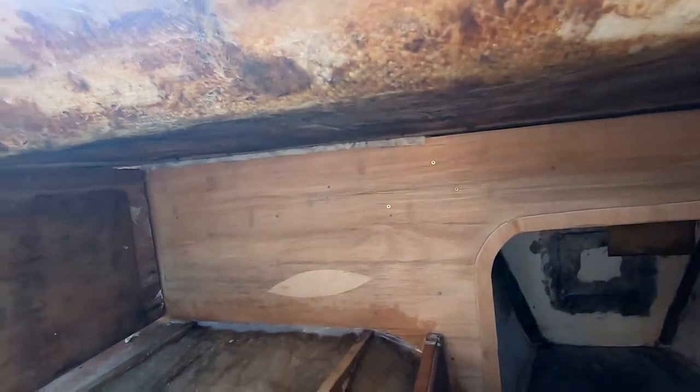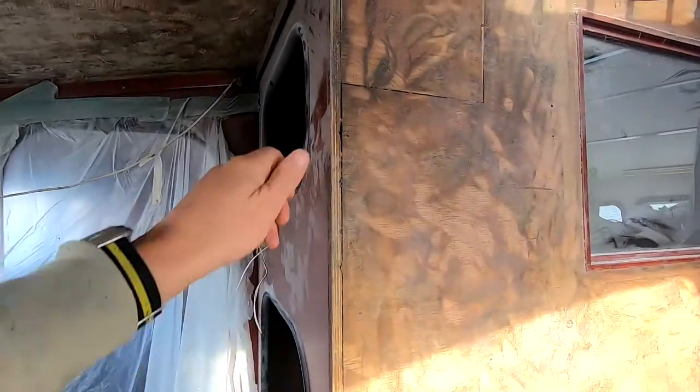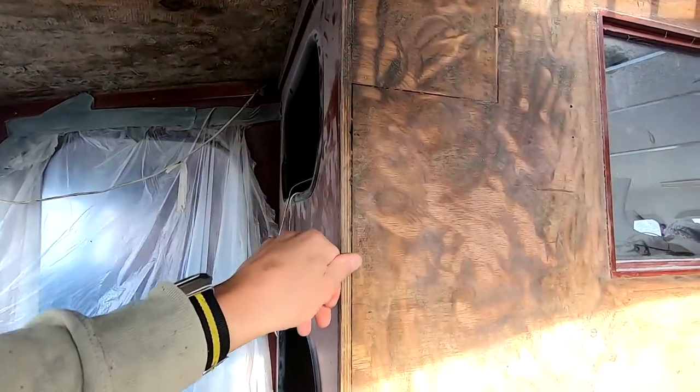Along the top there, where initially I was gonna have some CSM, I might just get a nice bit of sort of trim, mould, architrave type effect. Fit that in between woodwork to woodwork, places like under there, and I'll continue the CSM like they've got around here, just so it's in keeping with the rest of the boat. But the woodwork itself, I'll probably just put some mouldings in the corners. I'll take my router, put a chamfer on here. Yeah, so this one, we're getting somewhere.